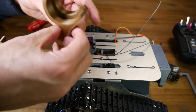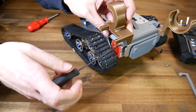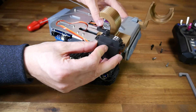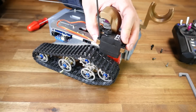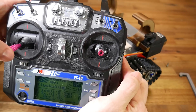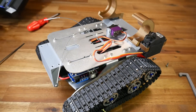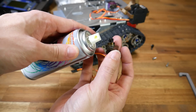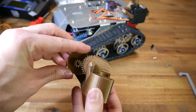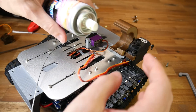After this is in, we're going to take the opposing part, which is pretty much identical apart from the mounts for holding the servo. Do a little bit of sanding if you need to, to make sure this one can swivel up and down freely. The larger of the two servos now slots in, and you can use a few M3 bolts coming down from the top to secure it — one on each side was strong enough. Now, the trigger servo was one of the hardest parts to get working reliably. I originally wanted to use a small servo to activate the nozzle, but it just wasn't strong enough. I tried a geared plunger system — still not strong enough — and also a 3-to-1 geared version, which also still wasn't strong enough. Only the large high-torque metal gear servo was strong enough to get the job done.